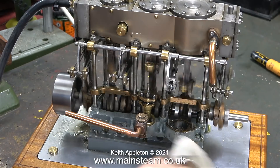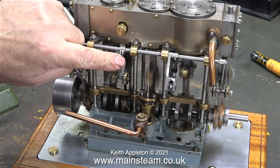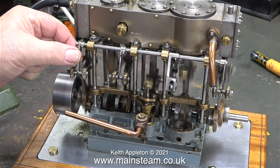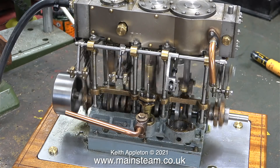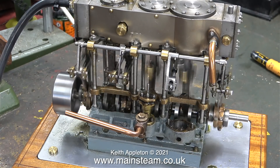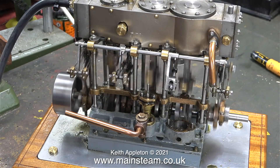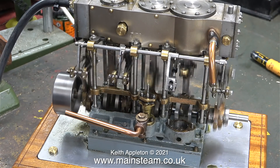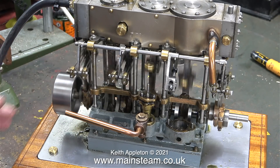Some of this knocking seems to be emanating from the very worn pins that go through the cross heads. One very good point - a good indication of the state of an engine - is the fact that the drop arms are not moving back and forth when the engine's running. All six of the eccentric straps are loose on the sheaves and need adjustment, and all three of the big ends need the same kind of adjustment - the bolts are quite loose. With the bad mechanical condition of this engine it's a good job it's a steam engine; if this was an internal combustion engine I don't think it would even run at all.